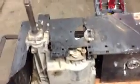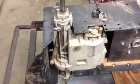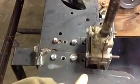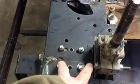This is the next lesson in this racing lawnmower quick start guide. What I've done here is I've actually lowered the frame by raising the transaxle up into the frame, just as I had talked about in the previous video. So what I did was I notched this out on the frame right down here, and when I did that I turned around and set the stock mount.